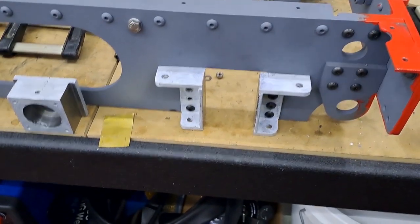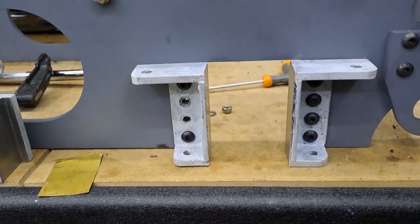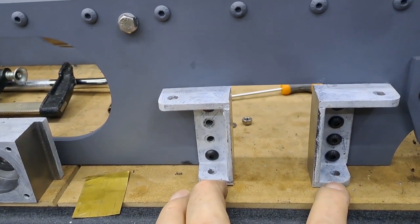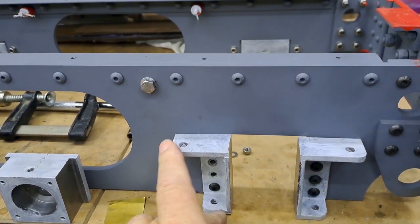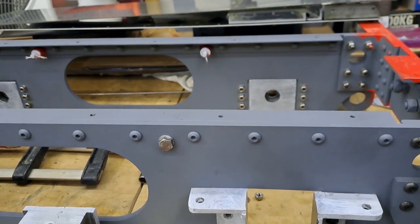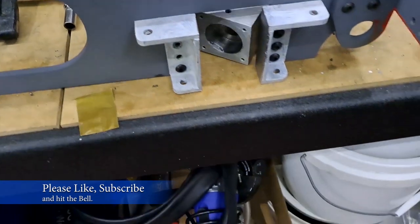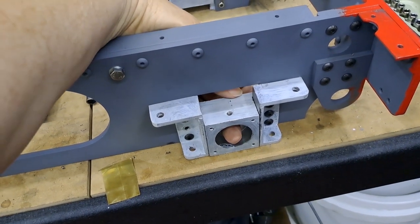As you can see, the horn cheeks are of a brazed, silver-soldered construction - there's a bit of angle in there, two little plates soldered on the top and the bottom. These bottom plates with holes hold on the horn keep, so it's a plate that goes across the bottom here that stops the axle box dropping out. These two slightly longer ones end up with the spring beam across the top, and there's a spring under here and a long bolt and a spacer that goes into the top of the axle box. The axle boxes come in from the back, so they're captive between the end of the axle - which is in the hole where my finger is - and they're free to ride up and down in the horn blocks.